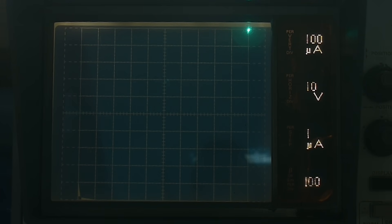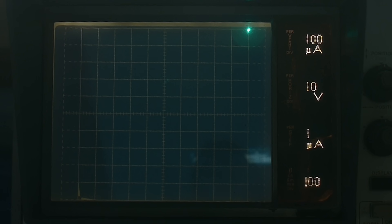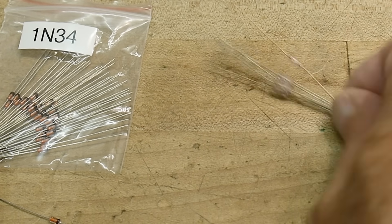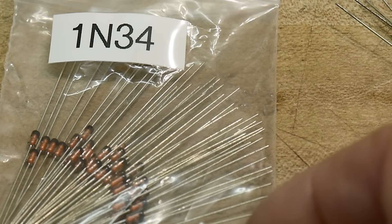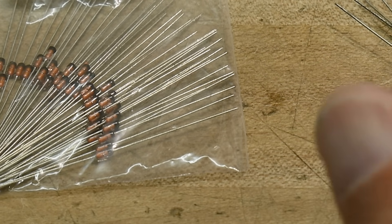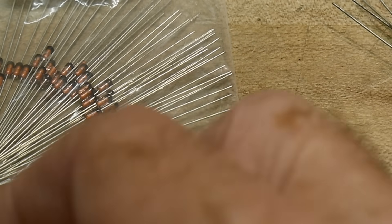And then let's look at those old 1N5711s and see how they break down. They break down with a weak knee as well. Yeah, those old Schottky diodes weren't all that great — the new ones are much, much better. Now I know: I believe these clear packages are true 1N34s — they're pretty big compared to a modern diode. These labeled 1N34s are probably small signal Schottky. I have these BAT85s I just got — definitely Schottky. And then I've got my 1N5711s, which are just oldy moldy and interesting.